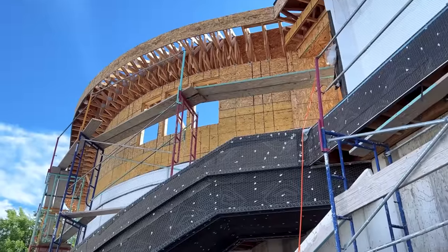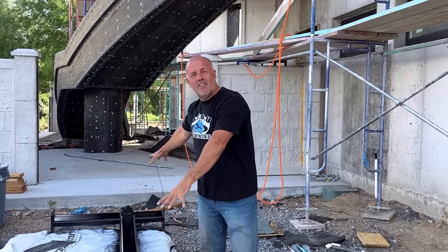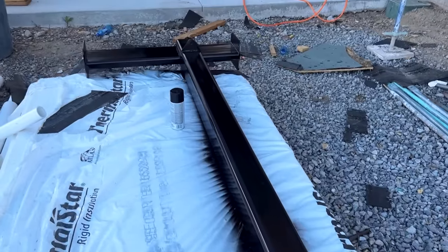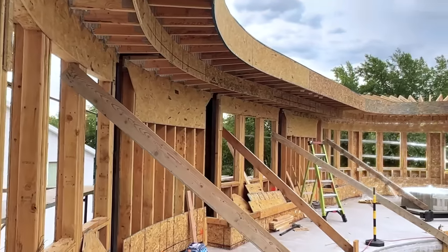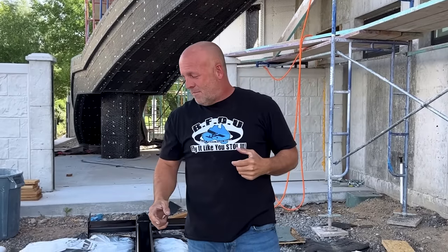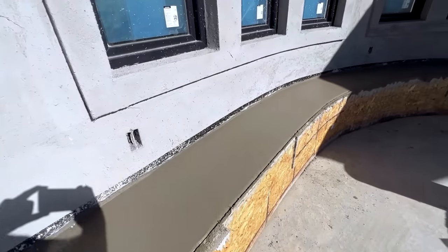I'm really excited because we're on to the next big phase of this pool project. It may not look like a big phase, but it is to me because we had to build all these big steel structures with sliding internal beams that allow me to install them. This is 3⅛ inch steel tubing, top plate and bottom plate — 8 steel members that go way up there. You can see the trusses. This is to keep the trusses from leaning side to side because I have a privacy wall with windows in it. The wall is only 6 inches thick, and I can't have the trusses that sit on top of it — that give me shade around the fire pit area and at the end of the pool by the deep end — lean side to side.